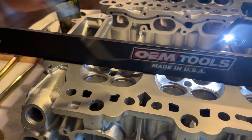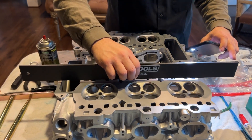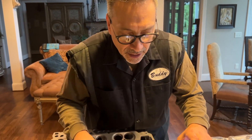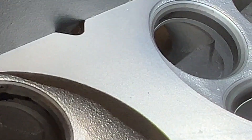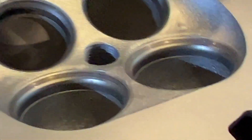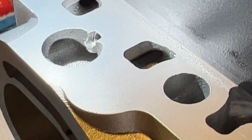With a four one-thousandths gauge you try to get in and it doesn't even — that's the real deal, that's probably what we recommend. We're gonna go through it and do it with a feeler gauge. But there is another spec on this which is surface roughness. I don't know how good a video you can get on that, but if you look at the reflection, if you get real real tight, there are little tiny machining grooves on this. Hard to see on camera, but on a bigger screen you might see it. It has a little bit of reflection — see those little tiny lines? That's like a surface roughness RA 80 or whatever.